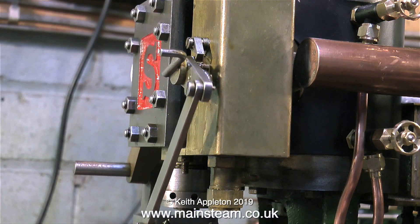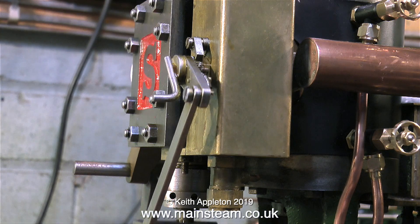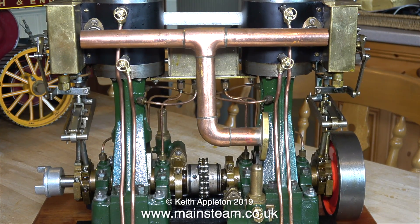I soldered the brass pieces to the pipes so you could take the pipes off and they retain the shape. Here's a close-up shot of the lubricator for the cylinder — it goes past two clicks but sometimes just one ratchet, but either way it's lubricating the cylinder perfectly.